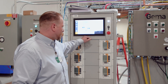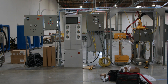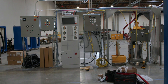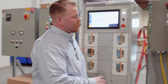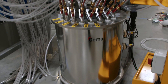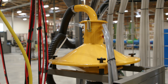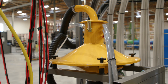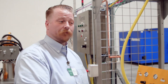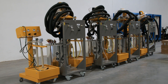Here we've got the CM40 from GEMA and the A2 cabinet. This is designed to control the automation for the reciprocators and for our entire powder system — it handles all the logistics and airflow. The powder comes from a fresh feed system: this is the 2P vibratory, which heads over to a 100-pound hopper with a vibratory sieve to add to the reclaim section. So we have virgin powder and reclaim for each color, with one spray to waste.